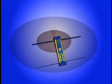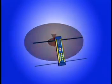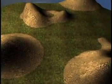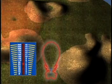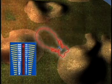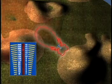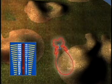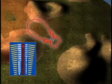By understanding how the VECTA-2 and the beacon's signal work, you'll more quickly learn how to operate it. The beacon's signal consists of a field of radiation that is shaped like a donut. While the signal travels directly away from the beacon in all directions, it can reflect off or be affected by variations in topography. The VECTA-2's Mini Yagi antenna array is most sensitive in front of the VECTA-2. As the VECTA-2 is aimed toward the beacon, and the more closely the antennas are polarized or aligned in the same plane, the stronger the reading will be on the unit's LED display. This is how you determine signal strength and direction to your objective.